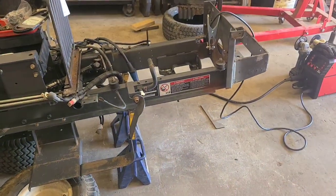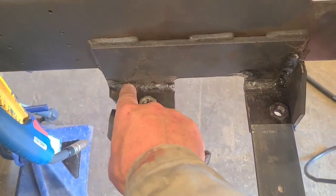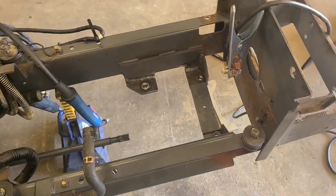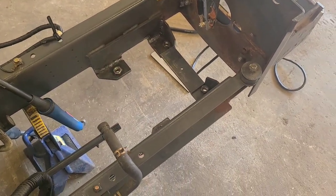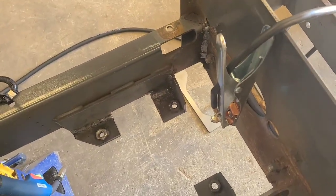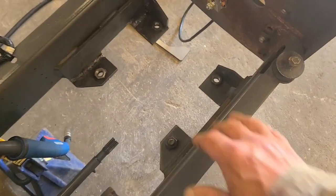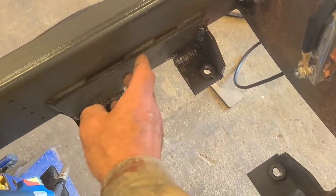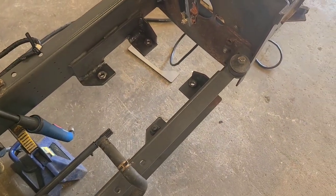So this is a rear steer mower. And the structural issues they've dealt with in the past, this had broke and they welded it. This broke right here and they welded it. Stuff has happened a couple times, so clearly there's a structural issue with this area of these machines. So what they found was, at one point you could purchase an entire assembly where all of this would get cut off, be eliminated, and it would be put in here and welded. You can't get those now.